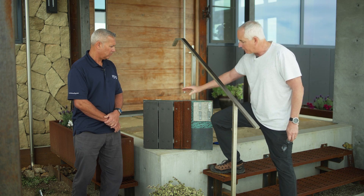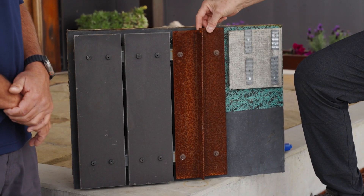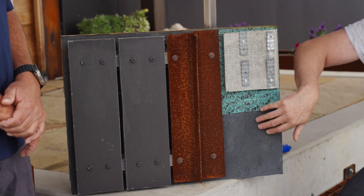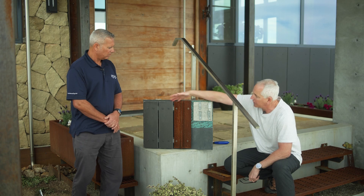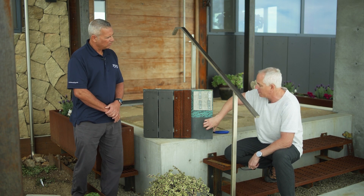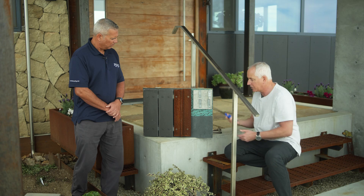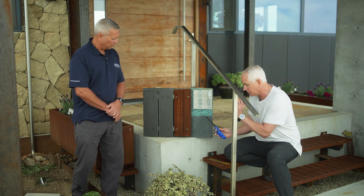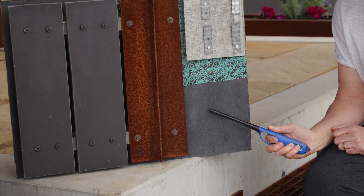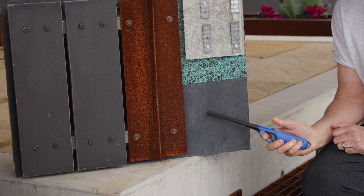Where we would start is obviously the shell where the metal is — metal's not flammable. Behind all of that, in what I have is called a rain screen design, there's a hollow space behind the material with this weather barrier. This is a peel-and-stick weather barrier, zero fire propagating rating. We can basically put a flame on here — and as you can see, nothing is happening. Absolutely nothing.